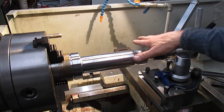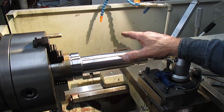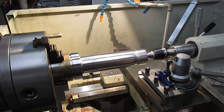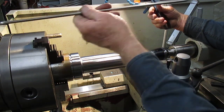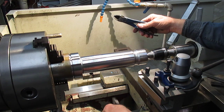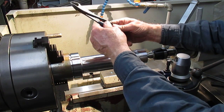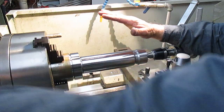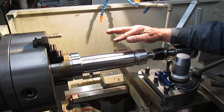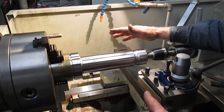After doing this work, the earlier video shows some of the machining which produced quite a lot of swarf. This is the time to talk about swarf and handling it. The way I use it: I have this rod for pulling when you've got stringy stuff — hopefully you don't need it, but generally for pulling it away. Secondly, I use these side cutters — with smooth handles, not rubber grips — to chop or pull it away. Don't use gloves or any other method except those two for pulling swarf, or stop the machine and stop the cut.